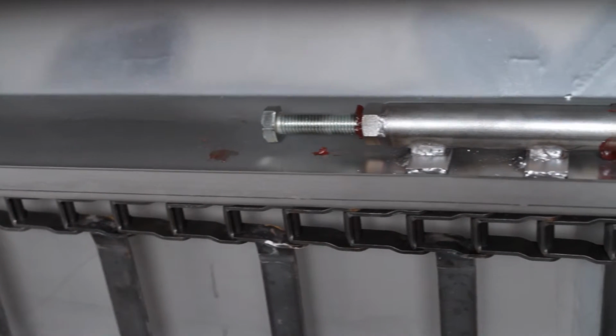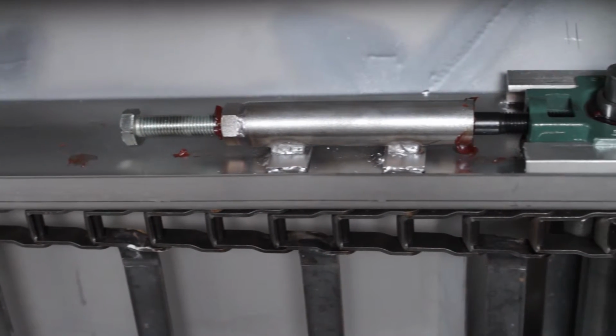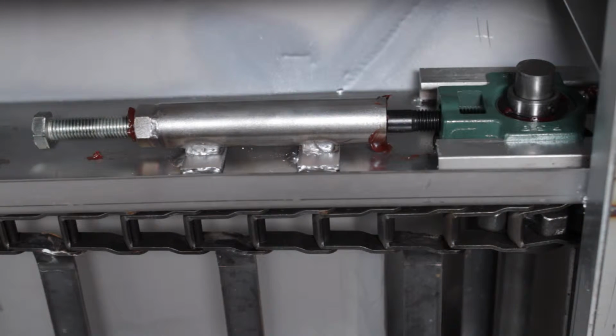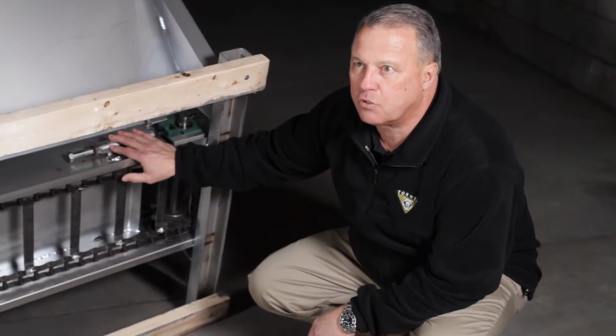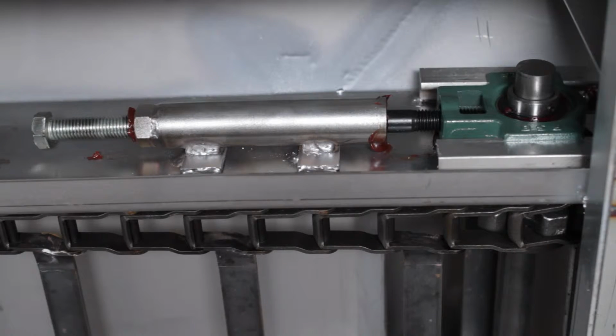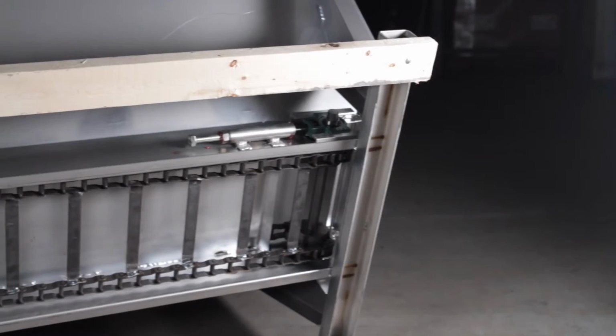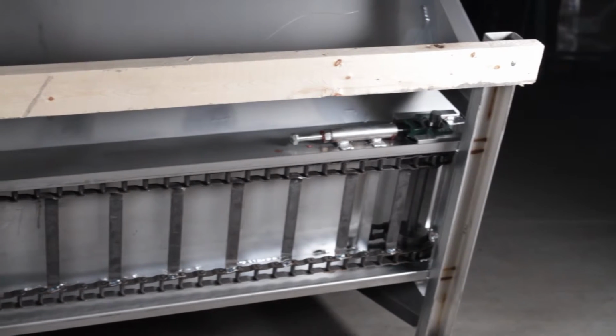On a 1-inch shaft, we have 2 take-up bearings adjusted automatically through a system that is unique to Torwel. We weld a stainless tube to the body of the unit and include inside this tube a couple of rivets and a spring, which keeps constant tension on the bearing, keeping force on the front of the chain, which always keeps the conveyor chain taut.